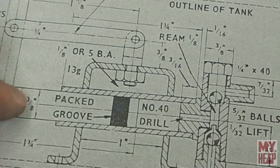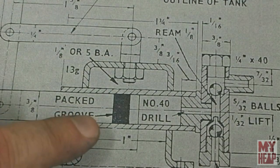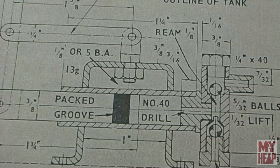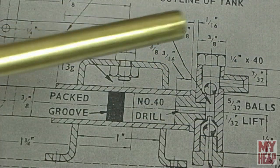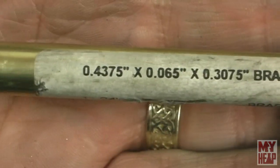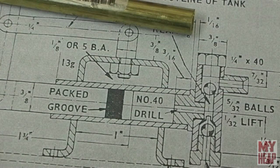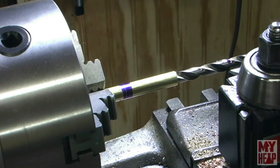The next thing I need to make is the pump tube - he calls it the barrel in the book. It needs to be one inch and three-quarter inches long. He says to use treblet tube if you can get it - that's tube drawn through a die plate three times - but I have some seven-sixteenths OD tube that will need to be drilled out and reamed to three-eighths ID, since the current ID is about 0.3075". I've got one drill bit one sixty-fourth of an inch smaller than three-eighths to start with.